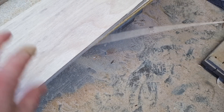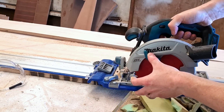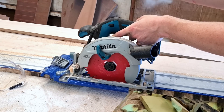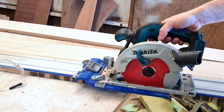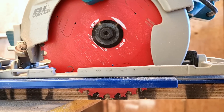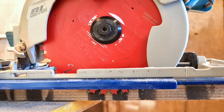With a little bit of depth control and practice, you can get it peeling off with pretty much no surface damage. You can't plunge, but yes you can be accurate with your depth with a little care. How I set my depth: put the track on the edge of what you want to cut, pull up the guard, drop the track saw down, release your height adjustment, gently position it until it just touches, hold it firm, re-lock the height adjustment, and you'll have the exact correct depth. If you want to go halfway down on plywood, set to that halfway line, lock it down, and you're running a dado halfway through that thickness.